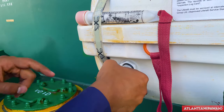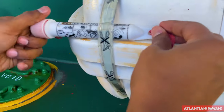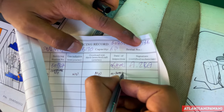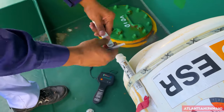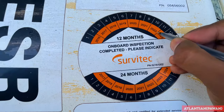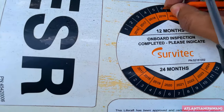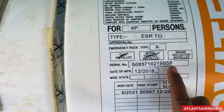Both CO2 and RH are fine. Remove the USB port - that's it with the test. Close the plug properly and make sure it is tight, otherwise water may get inside. This is the inspection card present on every life raft - take out the card, open the cover, and fill in the general information. I'll put the date of inspection as 1st June and add my signature. There is also a sticker for 12-month and 24-month inspection - scratch out the year and month on which you did the inspection.